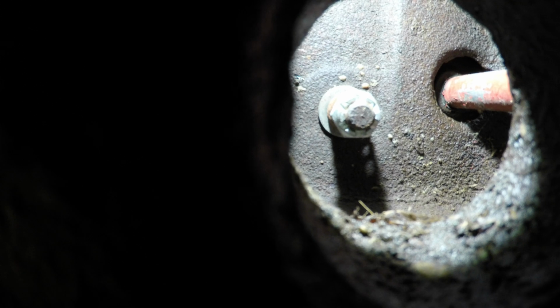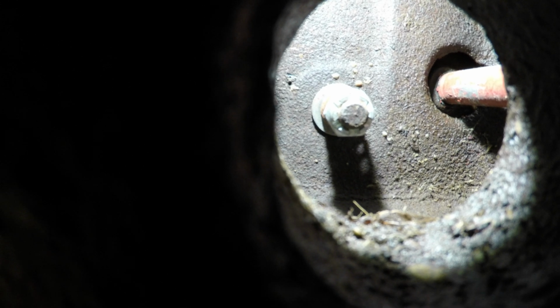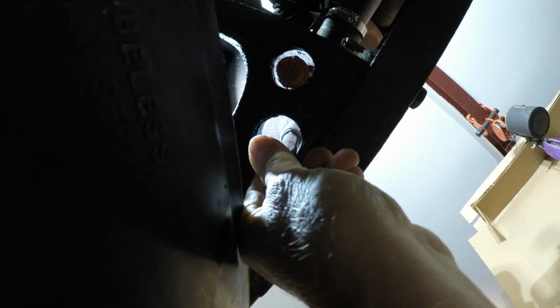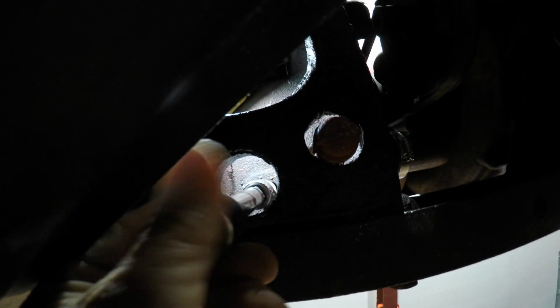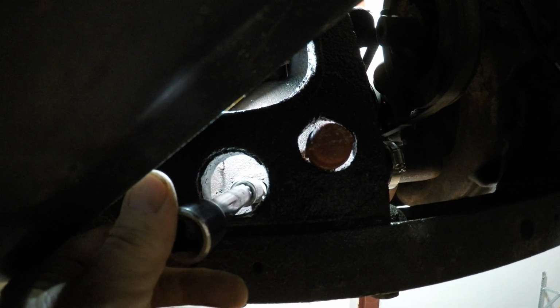And then I'll take an 11/16 inch socket and remove that nut on this side, and then do the same thing on the left side. I was just showing you, before I removed the pin, or the spring clip, that was holding that, going through the bolt. And I'm removing the nut, and behind the nut is a washer, or should be a washer, and a spring. Okay. That's not quite out. Anyway, I'm going to remove all that.